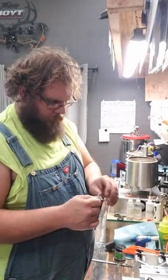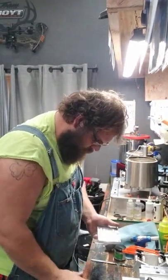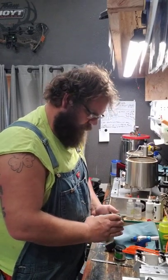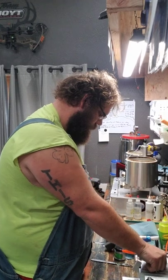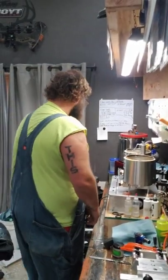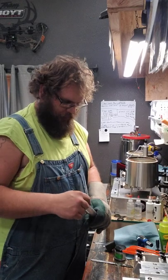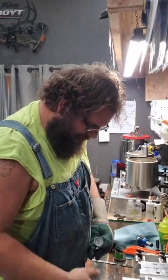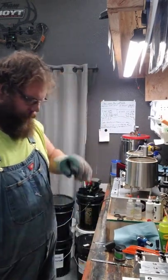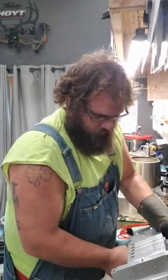I don't make a lot of core shots, but when I do, it takes time. Well, yeah. I ain't in a rush, dude. I'll get a little of the oil from the mold itself through the breathers. Do not push this button prematurely. Might end up with a missing extremity. That might hurt. It does. It's set at like 320 PSI. It ain't moving. That thing's pretty tight.